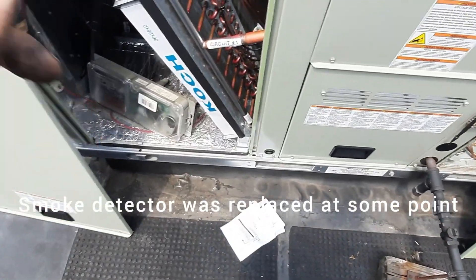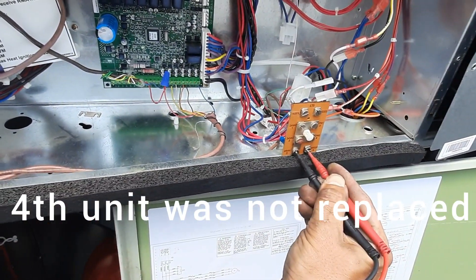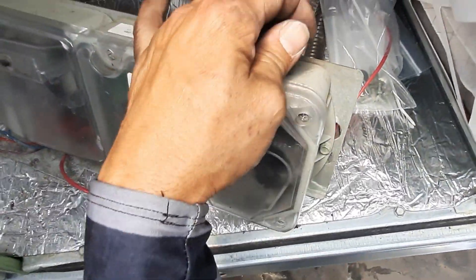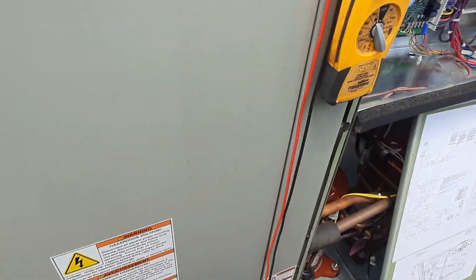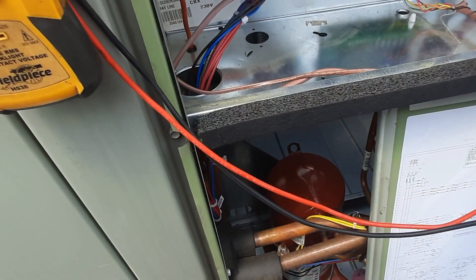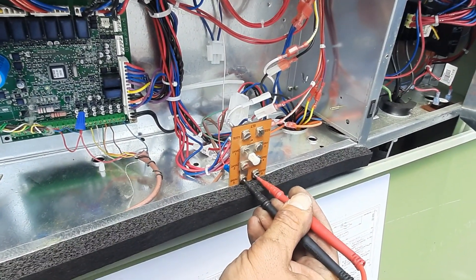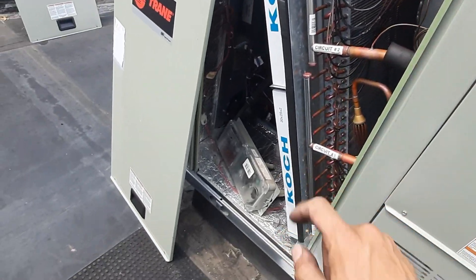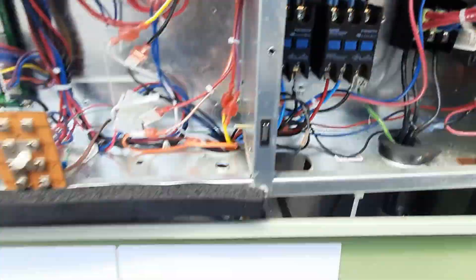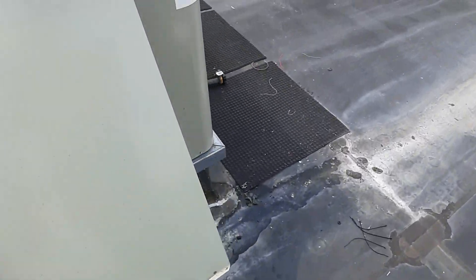This is what it should look like — the old smoke detector is still good. We're showing a closed contact on my e-stop, no voltage. The red light went on so we just tripped it, and you can see the phase monitor light went out. There's my 25 volts because it's an open contact now — so this one works. Hit reset, get power back to the phase monitor. That one's good, this one's good — this one here is going to have to go, so I need to work on getting a replacement smoke detector.